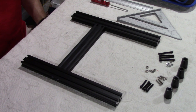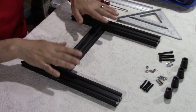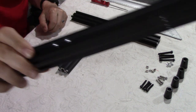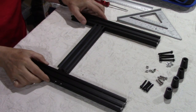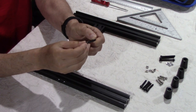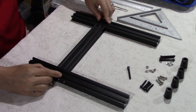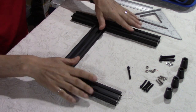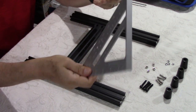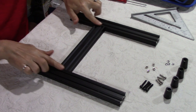The first thing we will do is build the frame. For this we will need screws from bag A01 and these three pieces. Make sure that you have the big hole facing down and the big holes on the outside. We will use the big long screws and put a lock washer — some people call it a spring washer but they're lock washers. We'll put two here and two there, but not all the way in. We'll check the square and the distance before we tighten everything, checking with a right angle and a ruler for distance.